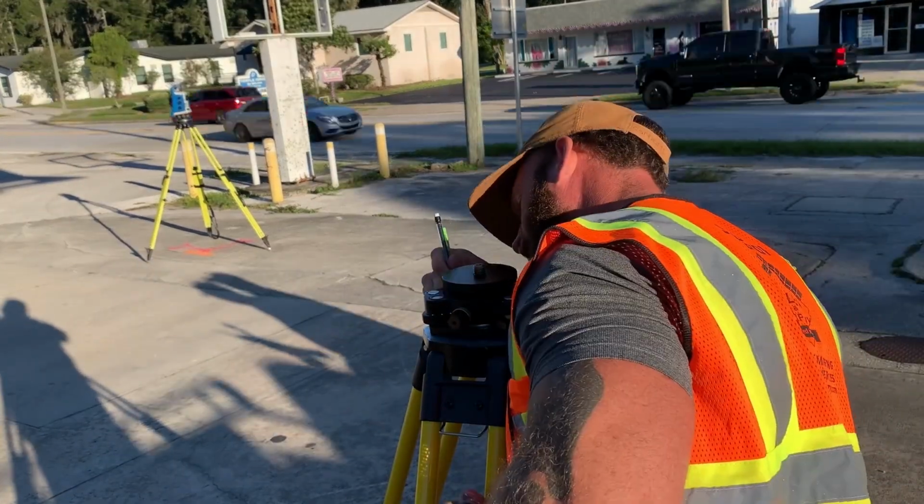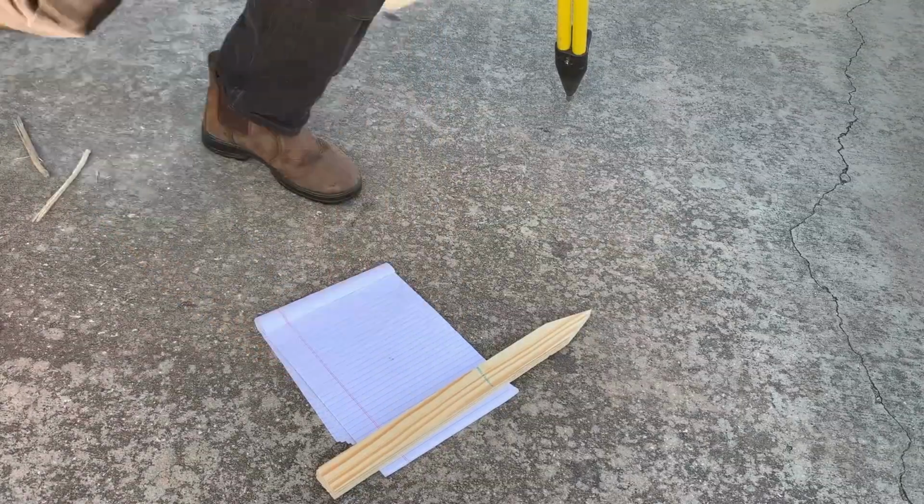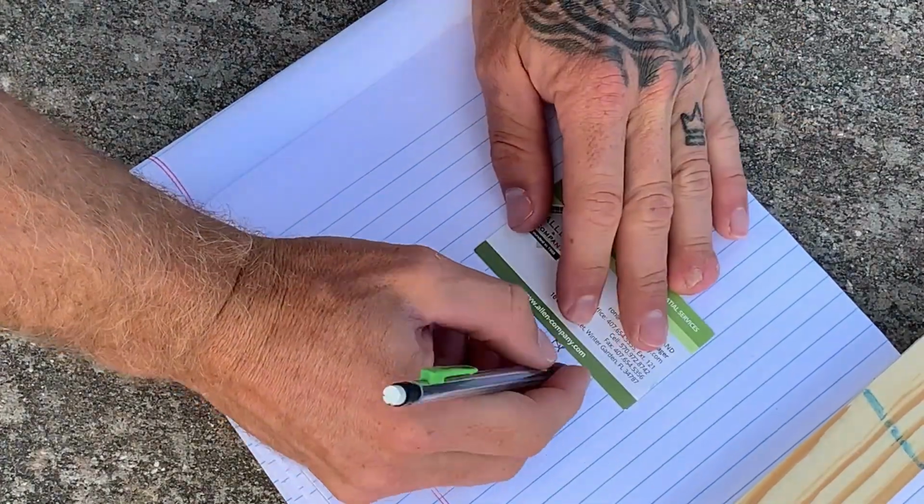One advantage a prism pole has over a tripod and Tribrach is that you can very easily check and adjust the fisheye level bubble of a prism pole in the field, which we'll look at shortly. But it can be trickier to adjust the optical plummet of a Tribrach in the field. It's still possible, just not as easy and takes quite a bit longer. There is also the very obvious advantage of transportability.